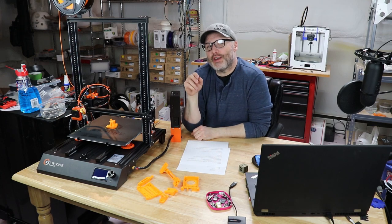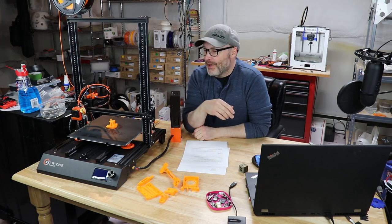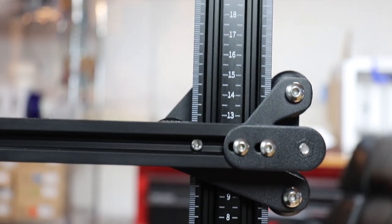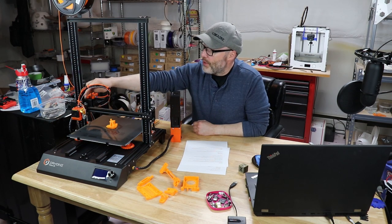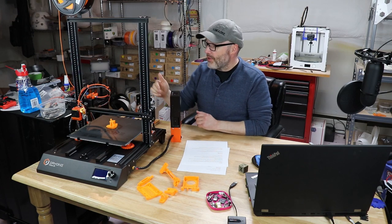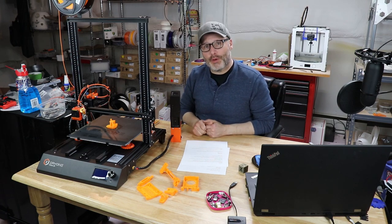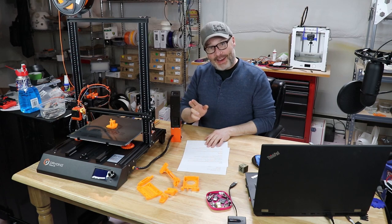Let's talk about some interesting things this printer has. On the very front of the rails, they have measurements. At first I thought — what would you use that for, to calculate how tall your print is? No — this is an interesting way to make sure your gantry is level, making sure that wherever one side is, it matches the other side. I thought it was novel at first, but I find I really like it — it's very convenient.